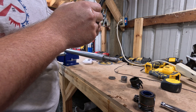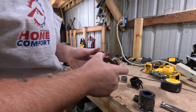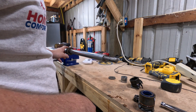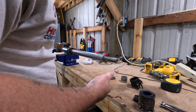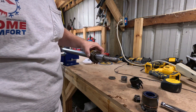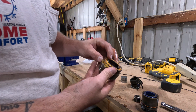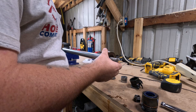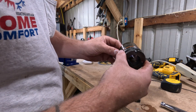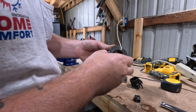All this one has is just a little wiper up here. That's pretty loose — that's not doing nothing for sure. Now that it's apart I might as well replace it since we have all the parts. So this is the gland — the gland always threads into the barrel at the top. The only thing my gland has is a wiper, and then we have this spacer piece which I've seen a couple of these like this before.